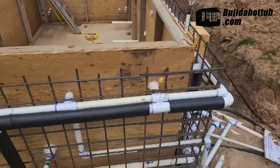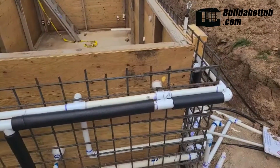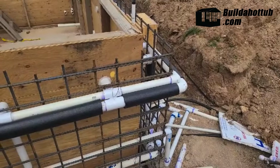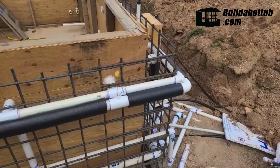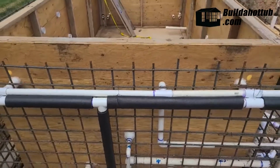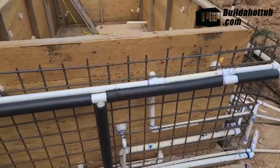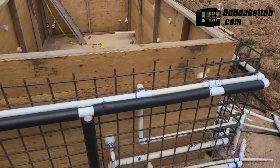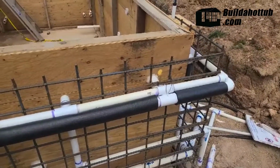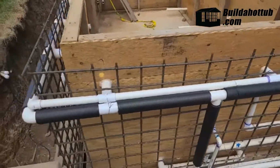I think a few things that I didn't totally understand building this is the gunite bodies put the 1.5 and 2-inch pipe really close together. So things like going around that corner there, the elbows have to be offset, and it's a little tricky. I made some mistakes, had to throw a few gunite bodies away trying to deal with that. So really pay attention to that if you're plumbing your own. If somebody's an engineer building a gunite body where the air is directly over the water, making it more flush and a little bit more separation would outsell all the gunite bodies on the market.